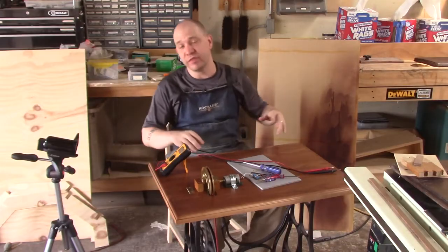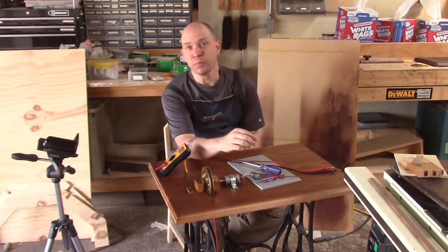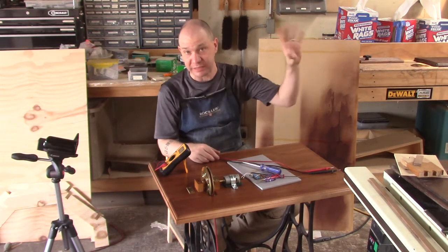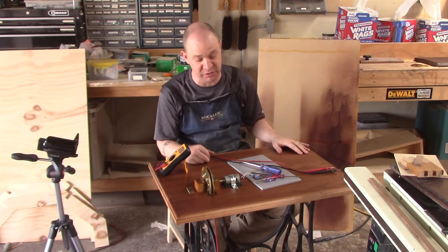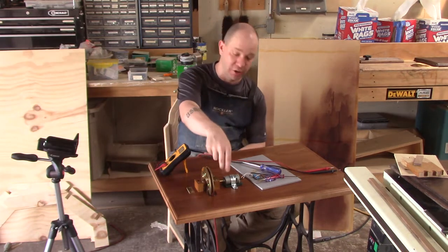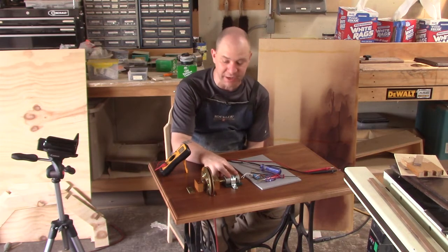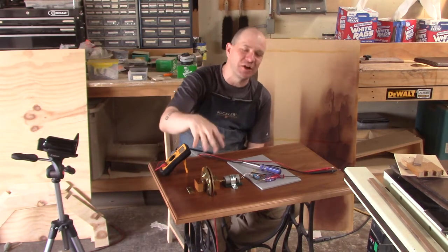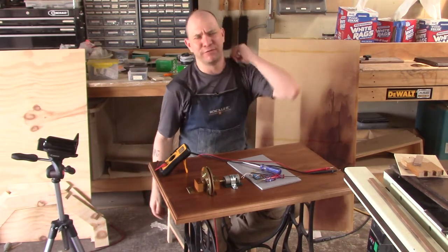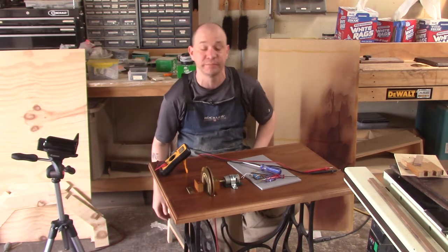We're gonna end up going with an Arduino, so this will be going into an analog in pin on an Arduino. We'd played with just using the voltage coming straight off of this to power some LEDs that are going to be involved in the next stage of this puzzle, but you had to get it really, really cranking. This motor, depending on if you turn it fast enough, it'll do 12, 13, up to 15 volts just fine, but you have to really get cranky, at which point you're going to end up maybe damaging this, because at that point, you're at about 1500 RPMs versus the roughly 500 RPMs of this.